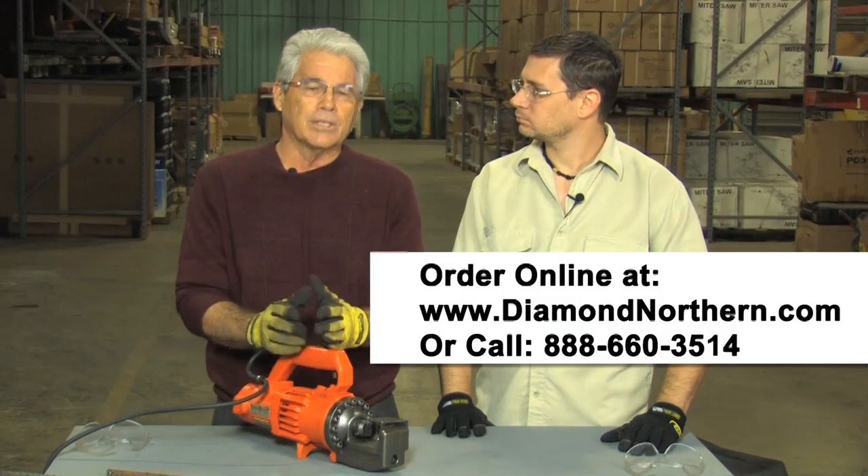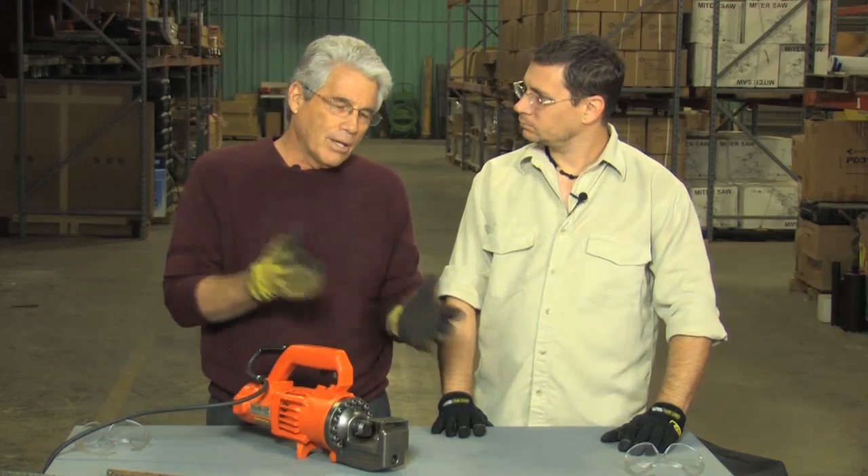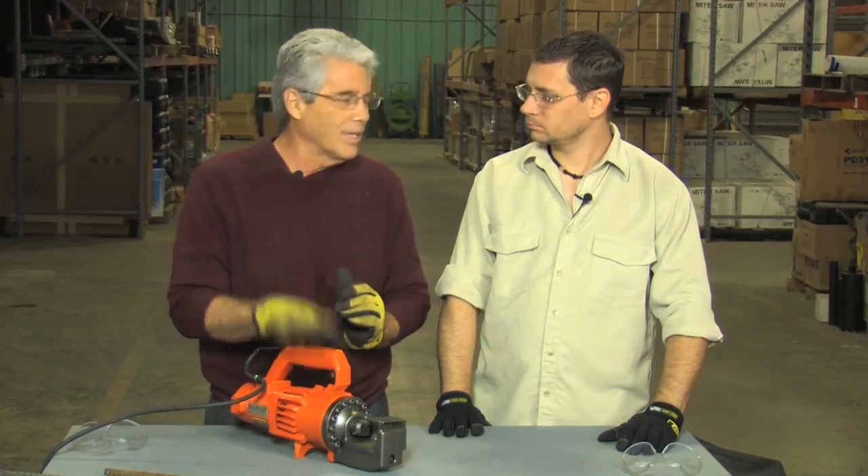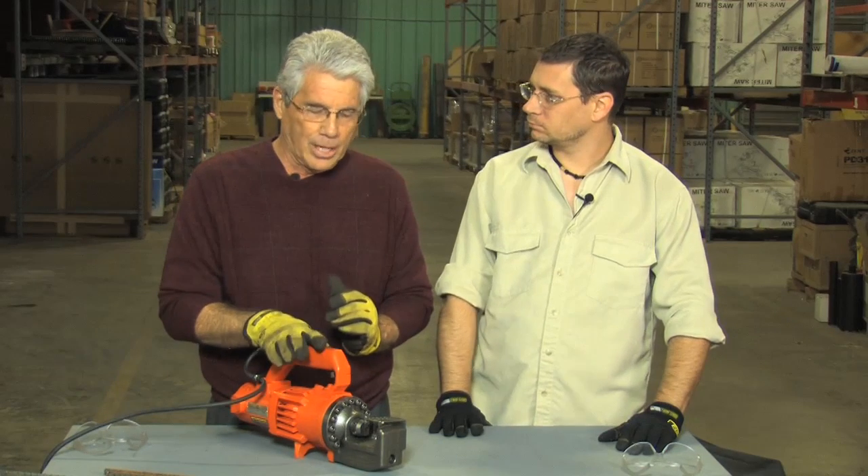This is important for earthquakes and other situations. They've also gone to a harder rebar — offered in the past at grade 40, now it's up to grade 60, so it's really tough. With a smaller size rebar, sometimes you can muscle through it with a manual tool. But when you're cutting number six, grade 60, you really want something like this tool, and it's a great product.